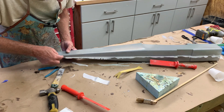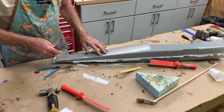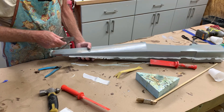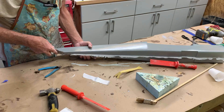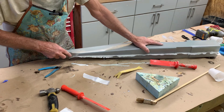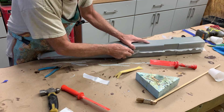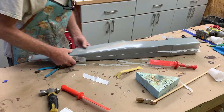This is where — remember I was saying — when your part is green you can trim the mold very easily without pulling the fuselage parts or the layup away from the mold itself. This is where it pulled away a little bit, so the epoxy got a little inside on the sides, giving me a little toughness.